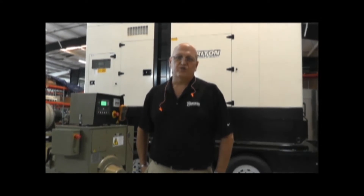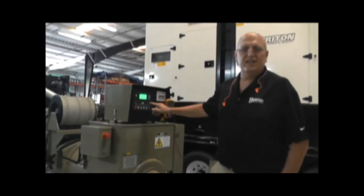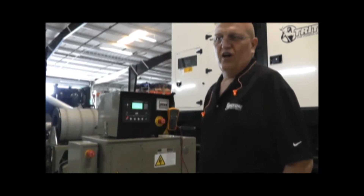This is a condition that you would have on a generator if your AVR failed, which generally would be manifested as seeing a low voltage or no voltage condition on your generator. In general, you would see an AVR fault on your control panel, seen as a low voltage or an under voltage fault.